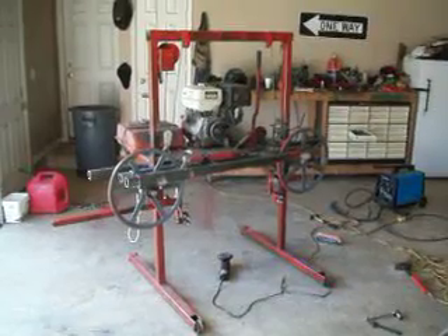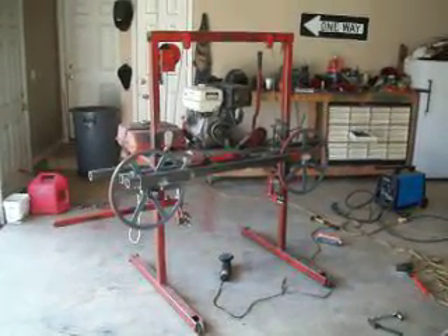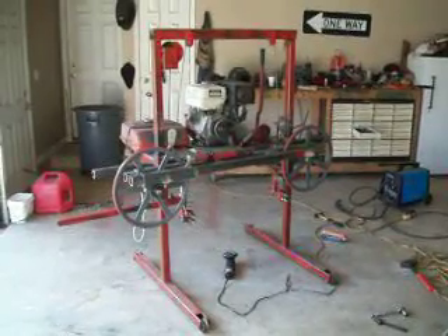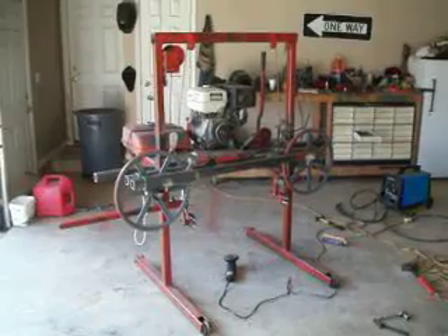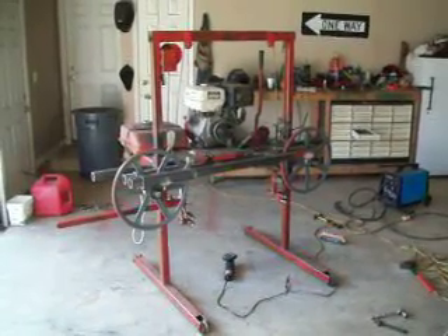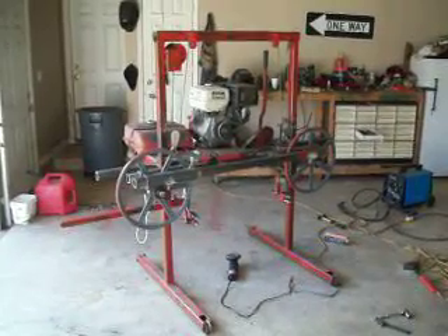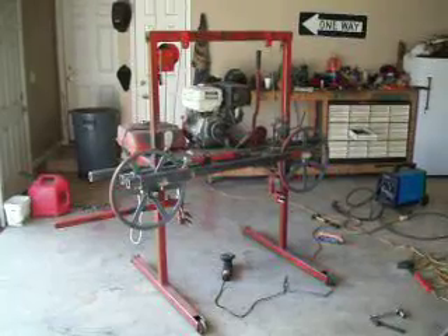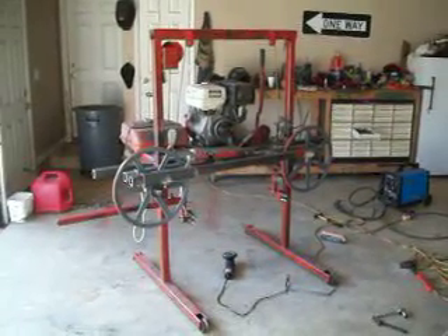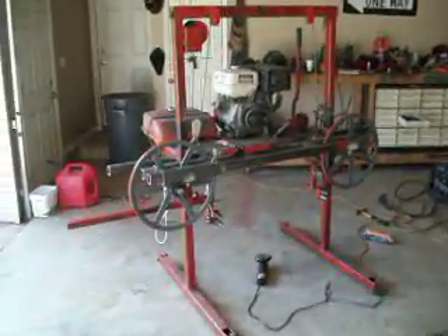Hello, and I know it's been a long time since I've recorded anything. I made some changes to my sawmill. I decided that my prior design with one and a quarter inch thick steel shafts wasn't thick enough — it needed to be two inch for that kind of design. So rather than buying new pulleys and shafts and bearings, I decided to go with more of a conventional setup.